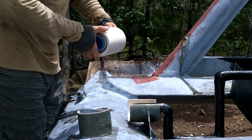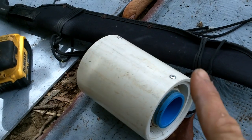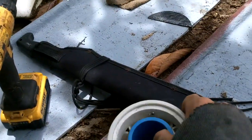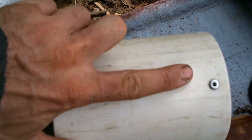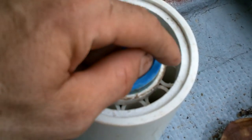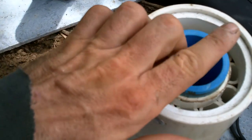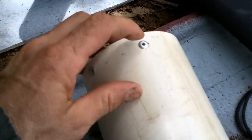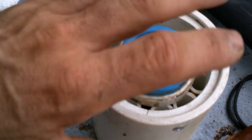A little bit stiff — I need to fix that. These bearings are getting stuck. Not all of them; two of them are good. I put the two good ones in the middle because I can't get those ones out. The two sticky ones I put on the outside. What I think is happening is the rollers are ending up twisting, which isn't a huge problem, except that they're wedged in too tight, so they're actually wedging themselves against the inner part of this and the ring on the other side — just kind of getting stuck. So if that theory is correct, I can drill out these rivets, pull this out a little bit, put it back in and it should be much smoother.